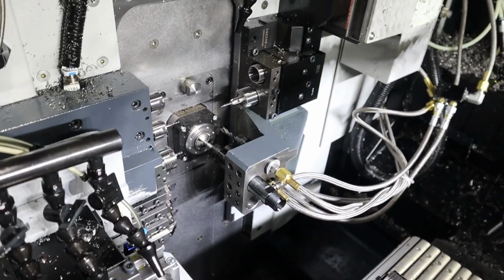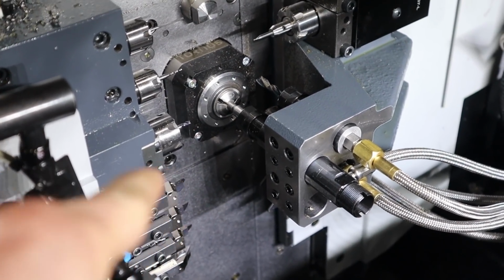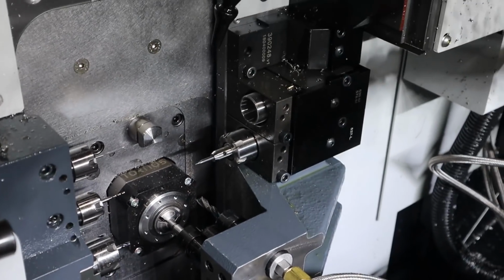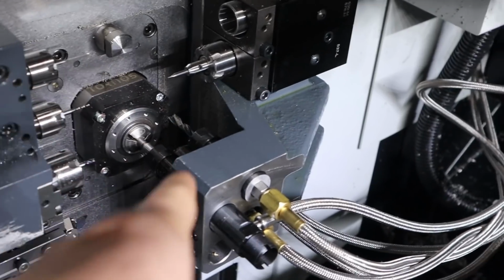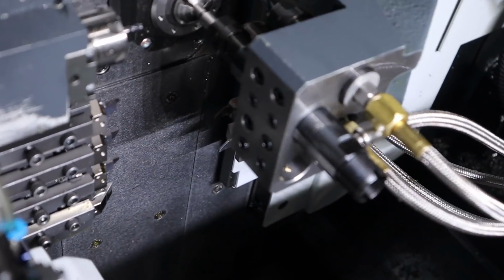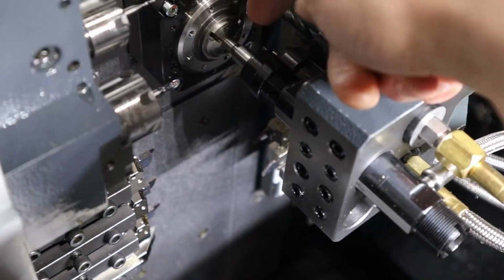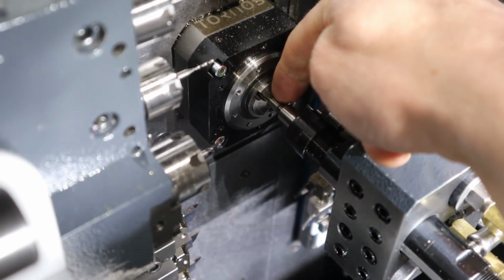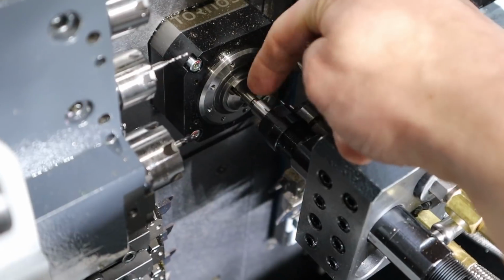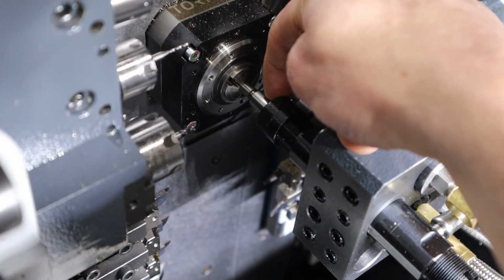Alrighty, I just spent the past very long time retouching off every single tool, making sure they're all perfect, just in X. Luckily, I had to tweak a bunch of them. Right now I'm doing the spot drill and the drill, and check out this little method I came up with to dial these guys in. So I had to go back to a 1/4 inch bar, I took out the brass, I put in 1/4 inch titanium, I put an end mill upside down in this guy, and I've got this drill bushing right here.